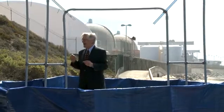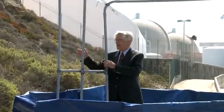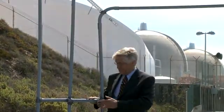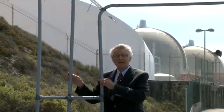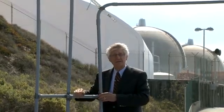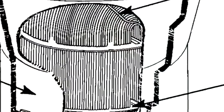What's happening in San Onofre now is that these tubes are vibrating. They're colliding with the pipes, with the pieces of metal that are designed to keep them separated. The vibrating tubes are hitting each other and hitting the support plates, and in the process it's denting the tubes. Some of the dents have gotten so bad that the pipe wall is completely worn away, and the tube has to be plugged.